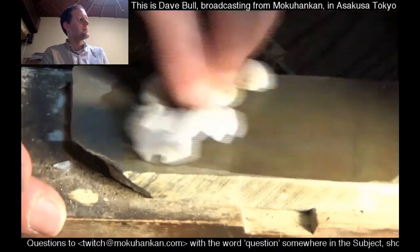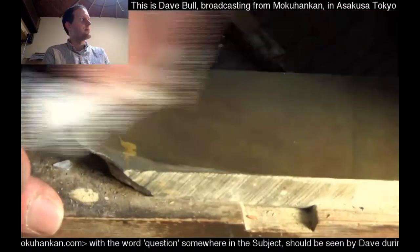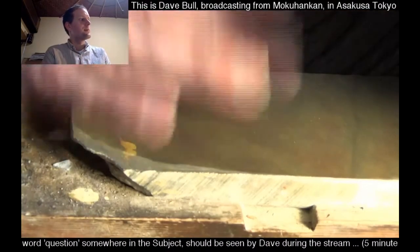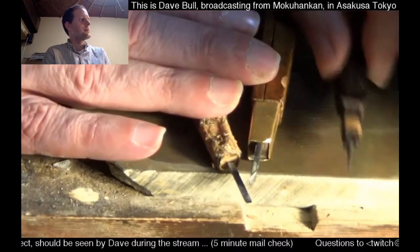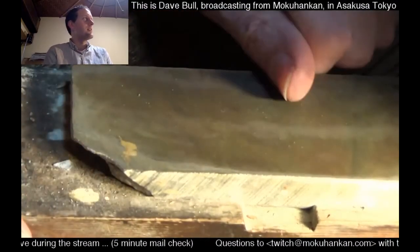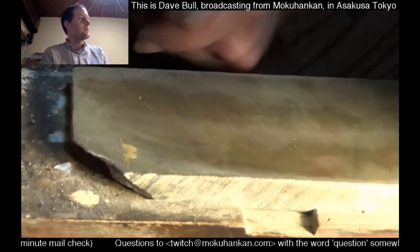What I would normally do, before I start working some given session, is sit down and think, yesterday the blade was giving me a bit of trouble. So you sit down and you do all your knives. What have I got? 3 or 4 of them. And you do them all in a bunch so you don't change stones. You pull out the medium stone, do them all on the medium stone, put it away, clean it away, bring out the fine stone, and do them all on the fine stone.